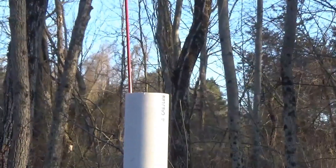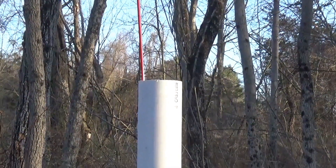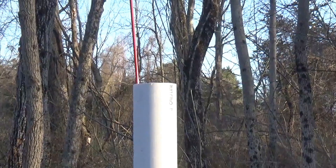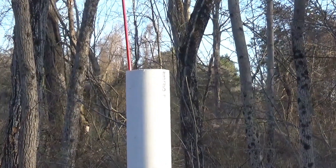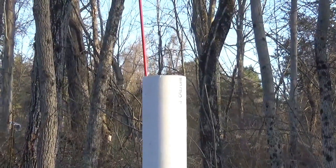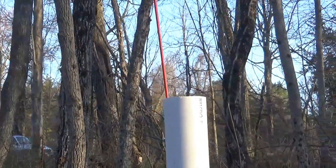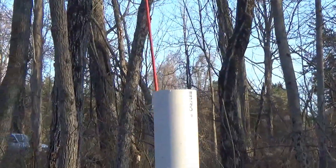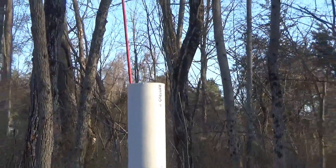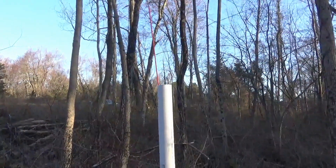That's pretty good. That tape line is only a little bit below the top of the pipe. So that means that even with the pump operating, our supply is solid. We're keeping that standpipe full of water and there's enough flow to support that. There's no air bubbles or air lock issues. I'll jump up on the stepladder here quick and give you a peek at how close to the top that tape is.